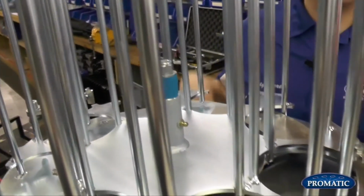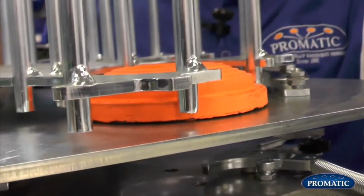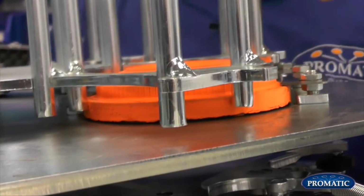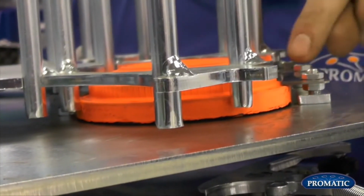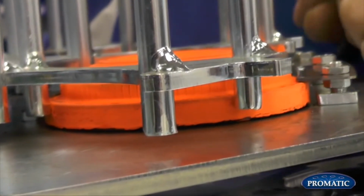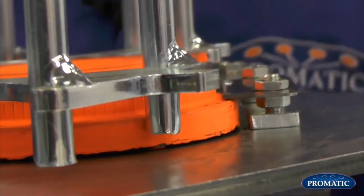So now we put that back on, we'll just come back in and check our knives. So as we bring the clay in, make sure we're right front and back. We've got an equal gap from the outside of the blades to the drive band. We've got the thickness of our thumbnail when it comes to the height, so we know now that knife edge is set correctly.